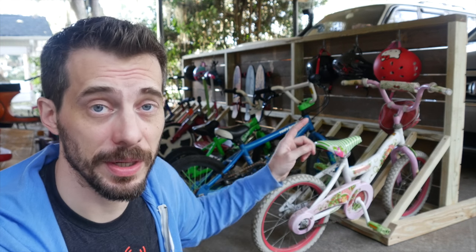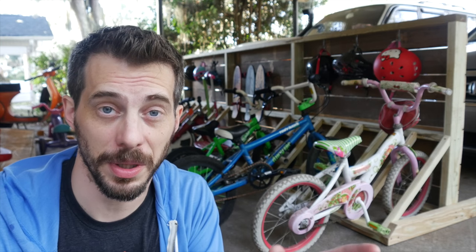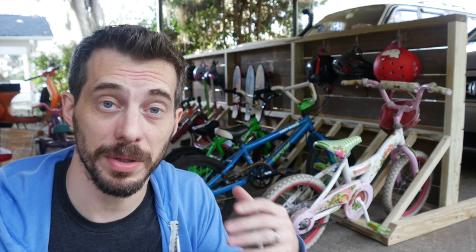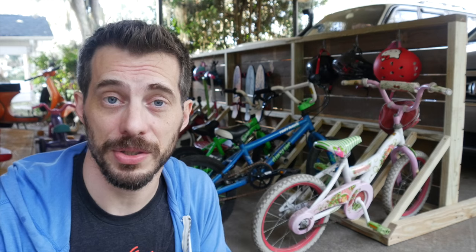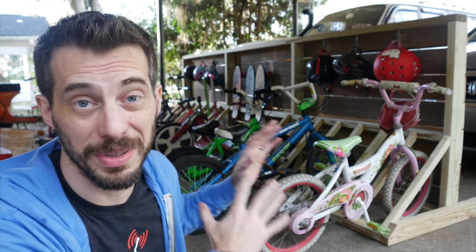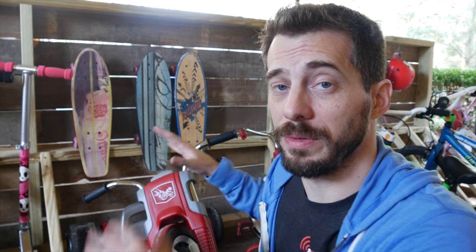I did have to go back and spread out the pieces to make the slots wider, because the bike I originally measured had a fork that was actually smaller than a lot of the other bikes. Some of the larger bikes didn't fit, so I had to spread them out to six inches. You're going to need to measure your bikes or scooters to make sure your gap is as big as you need it to be. The center section I left open so we could put big wheels and tricycles in the bottom and skateboards up top. Our kids have small boards, so I didn't make any sort of a hanger — they're just sitting up there. If you had full-size boards, you could make a piece of wood with some slots cut in it so the boards could fit in and stack on top of each other.